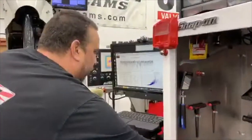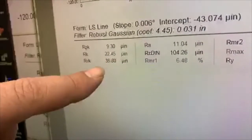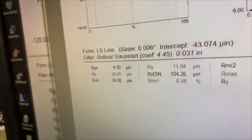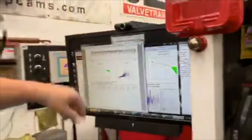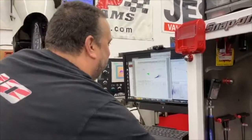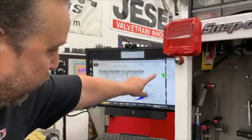So if you want a full-on race finish, it's going to be a lot smoother. If you saw that, the numbers come way down. Now we're talking 22, 35 - almost half the number - because we won't have ring break-in or anything like that. And you can see the valleys, how much shallower they are. You can see peak-to-valley comparison in this little green graph compared to how much difference you have from peak to valley in that other graph. That's how you can justify that difference - different applications, different surface finish requirements.